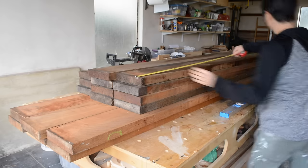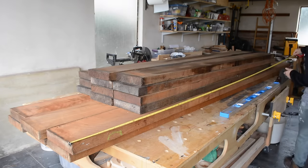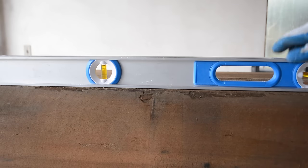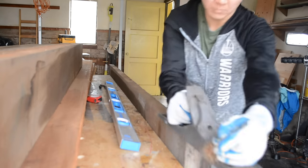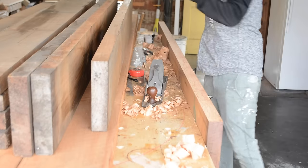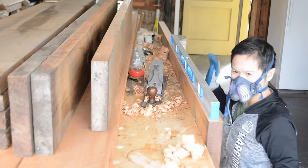For this project I purchased 2x8 cedar wood from a lumber supplier. I got vertical grain, nearly perfect wood with no knots, which is expensive but worth it. The wood alone cost almost two thousand dollars. I start by cleaning off one side with my longer hand plane. I'll use this as a reference face for cutting on the table saw.